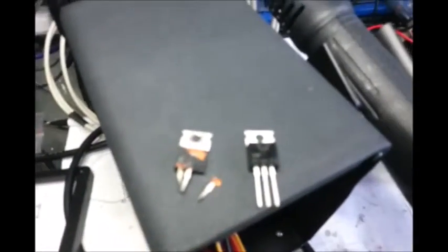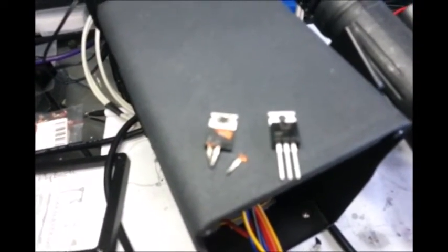What it says is: BT137 600E MPX triac. I'm going to pop this in and we're going to see if this works. We've got that soldered in. I tend to just very gently spread the legs slightly, then put the screw back in as well to make sure the heatsink is sat correctly, and then I solder. I'll just nip these leads off with the wire snips and then test it out — connect it back into the fascia, put the nuts back down, and I'll find a little shake-proof washer. Well, I couldn't find one, so what I've done is tightened another nut on top of the nut, which effectively works pretty much in a similar sort of fashion — this can't undo because this one's on top.